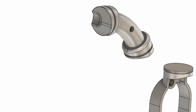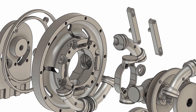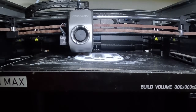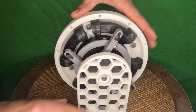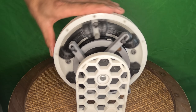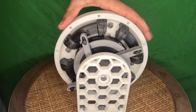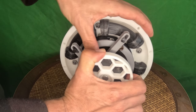I've got a bit of a different concept that I sort of touched on in the last video, where the whole housing spins. It ended up being a little bit more complicated than I wanted, but I couldn't think of any other way of making it. Now the whole housing spins, and there's no need for any seals in the combustion chamber — the only sealing now is done by the rings. The conrods connect to the pistons through a slot in the housing which never gets exposed to combustion. The pistons are moved back and forth by the conrod running in an ellipse shape that's inside behind that white piece there.